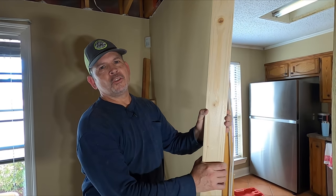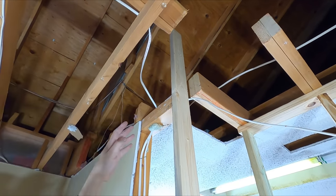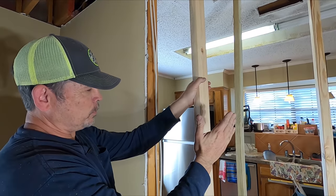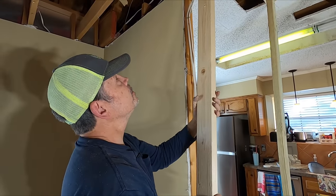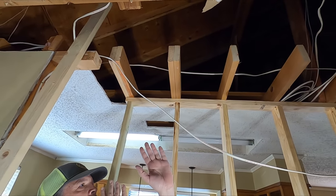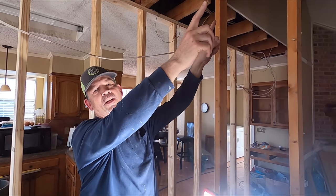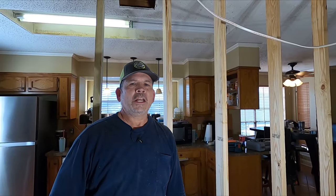We brought one of the 10-foot 2x4s in here to show you what our king stud is going to look like. We're going to let it run long into the ceiling in case we need it to attach bracing. We'll have two king studs and then three jacks holding up the beam — and what do you call three jacks? That's a stud pack. There was something on the nailing schedule for all these studs that I was concerned about, so the structural engineer is actually reworking that for me. Along with that and the fact that the beams aren't here, we're going to call it a day. Once we get that beam in, we can probably hit the second one the same day — my goal is to get both beams up, probably in two days.